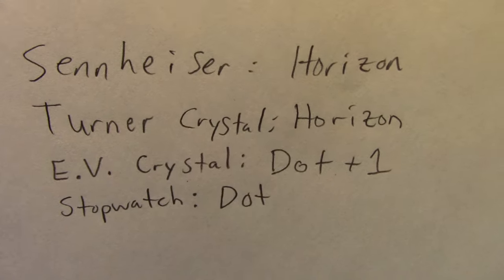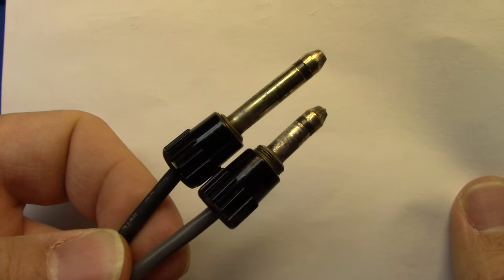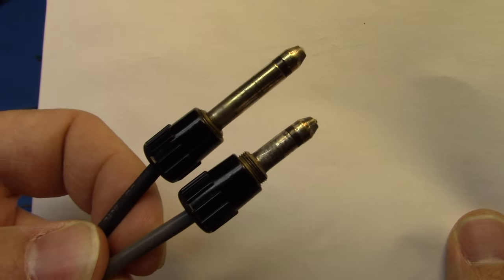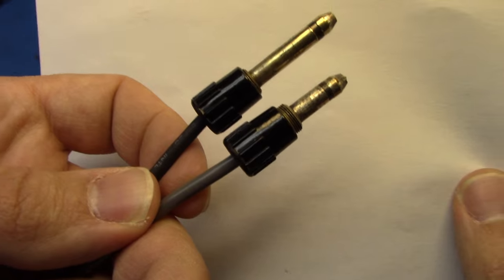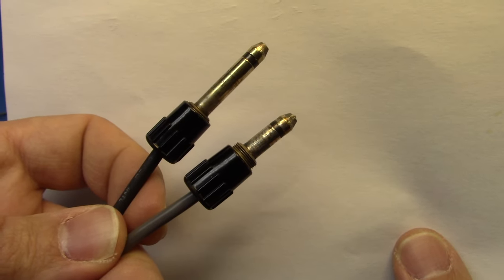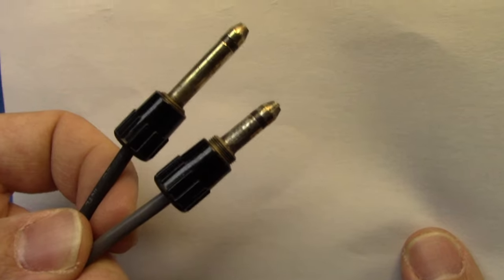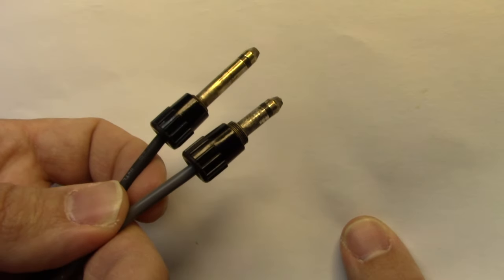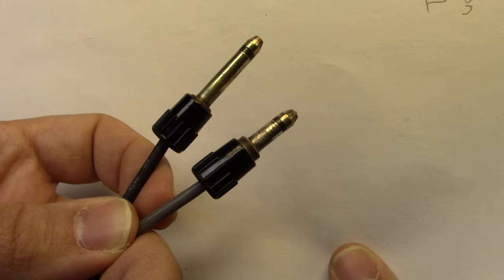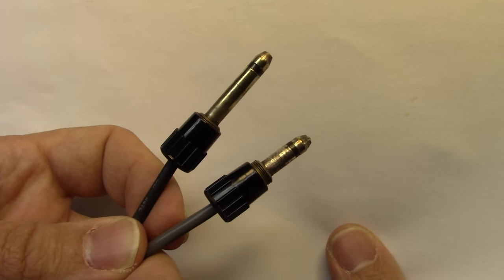This is a helpful guide I've come up with for recording level settings. You may have noticed the Minifon has only one connector — one jack — for both input and output, and there is no switch to switch between record and play mode. On the machine you just have a start/stop, rewind, volume control, and your input jack. How does it tell between record and play? It has two different jacks: the short jack is for recording, and the long jack is for play — when you plug the long jack in, it activates a switch that puts the unit into playback mode.